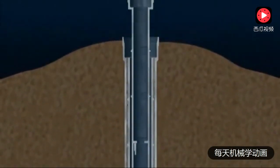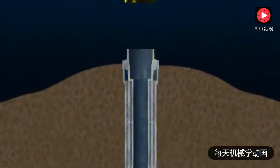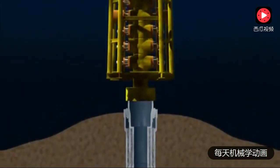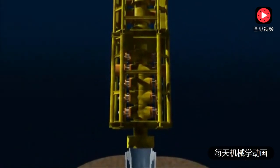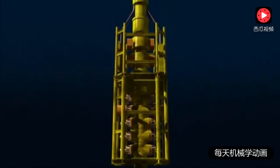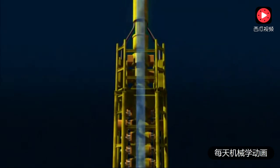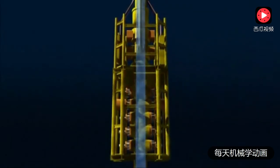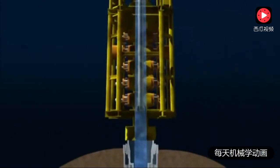This first casing run has an attached wellhead. A blowout preventer, BOP — a robust set of valves that can shut in the well even if the drill string is down the hole — is then lowered and locked onto the wellhead. The BOP is connected to the sea surface by large diameter tubing known as a riser, which allows drilling fluids to be returned to the surface. From this point onwards, the drilling procedures are similar to those used to drill an onshore well.